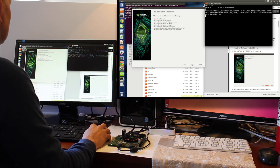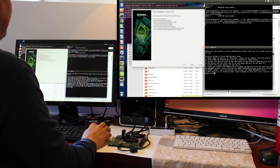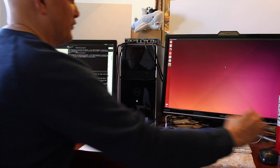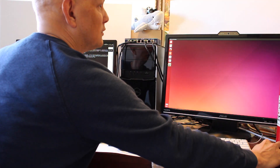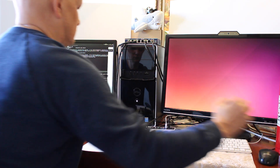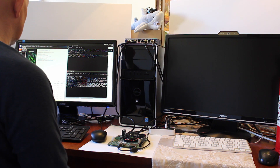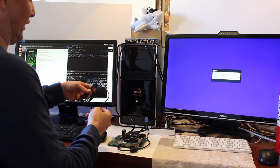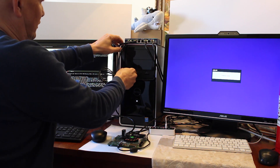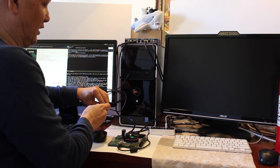Next. Next. We're ready to place the device into forced USB recovery mode. So let's turn off the Jetson. We'll take the supplied programming cable, plug it into the USB port of the PC, and then plug the Jetson in.